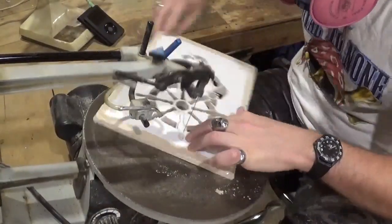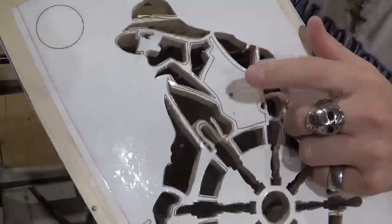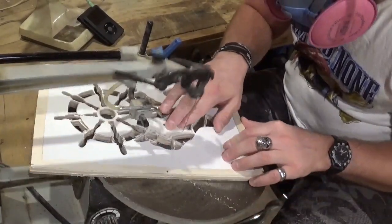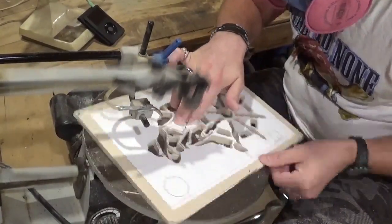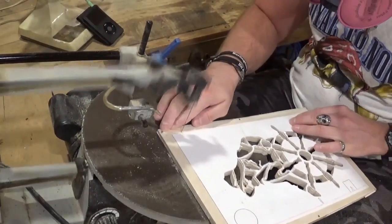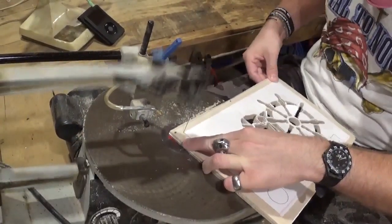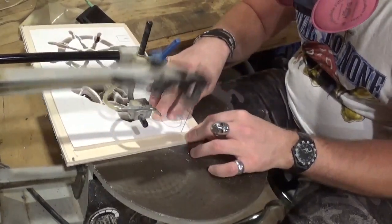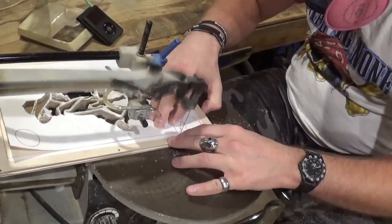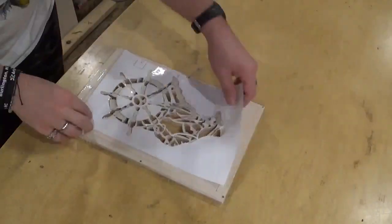In this next cut — the final inside cut — I'll show you the little nail in the center, and we're going to do this cut. All the internal cutting is done, but I will do one more pilot hole cut because when stack cutting you don't want to start from the outside of a piece of wood and cut into it — you want to start with a pilot hole for stability. I had to back it up and go the other way because swinging the piece around would have hit my camera tripod, but once I get back to the pilot hole I cut through, and all the scrolling for this project is done.